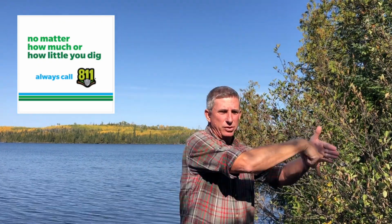So a very, very good way of doing it is when you dig your trench, that you scrape all your tailings off, and then start measuring with a 2x4 across the trench, down to the trench bottom, as you go along, making sure that you have just a little deeper, little deeper, little deeper. And make sure that trench is nice and clean, nice and flat underneath there. You can even put a small sand layer in if you want to make it just perfect. That's a good professional way.